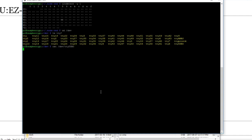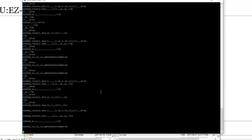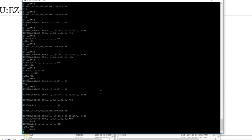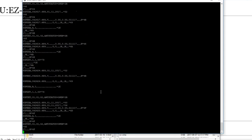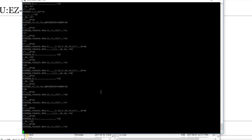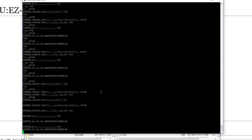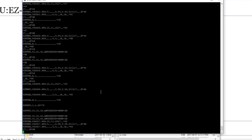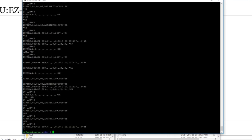Here's what you should get — NMEA data streamed from the GPS device to the Raspberry Pi via the USB port. This is not going to be capturing a signal right now because I'm in the basement and it won't be able to get a lock on any satellites. So before we're done, I'll move it upstairs where it can get a signal, connect remotely, and have a look at the data that comes out.